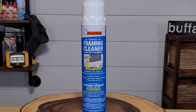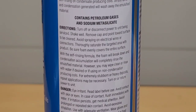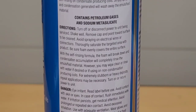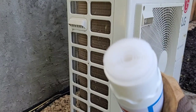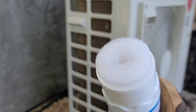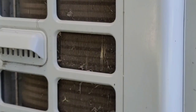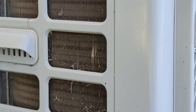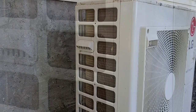The can I purchased is by Frost King — it's an air conditioning coil foaming cleaner. Make sure it specifically says it's for air conditioning coils; there are other cleaners you should not use unless they say so. The can has detailed directions on safety, including what to do if it contacts your eyes or skin, so read the directions before use. First step: really shake up the cleaner. There is a brush on top you can use to clean out the coils — use it with caution so you don't damage them. The coils bend easily, so pay special attention not to put any pressure against them.